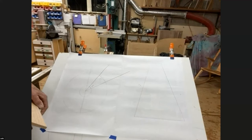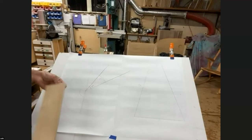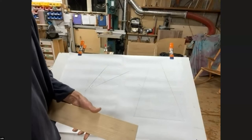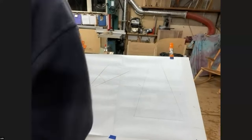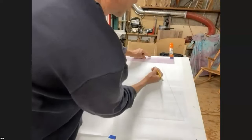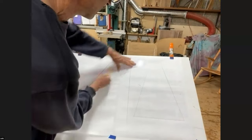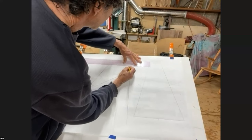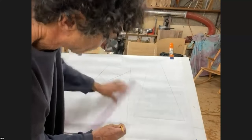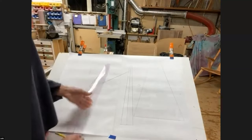You mentioned the book that George wrote — you're talking George Walker? Oh sorry, different George. George and Jim. So after that, what I do is I can now draw a stave. If I use that as my center line — I'll just draw it over here. So if I draw a piece that is 17 inches high, seven-eighths wide at the top and three inches wide at the bottom — that's what each stave is going to look like.